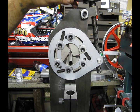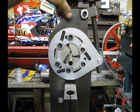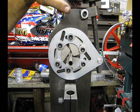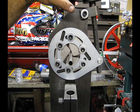That's locked down on half inch thin wall tubing — I think that's 0.065 wall. For that size it's really not that thin a wall. But you can see that the Stellar Performance TN250 replacement jaws really do what they claim, from two inch right on down to half inch. I'll see if I can find something a little smaller and see if we can clamp down on that — but that's quite an improvement.